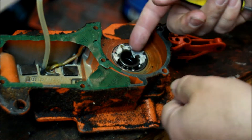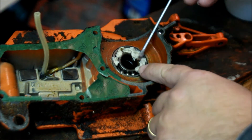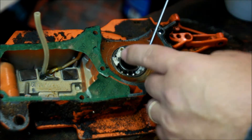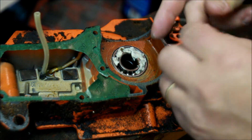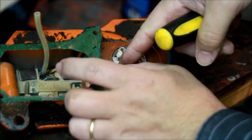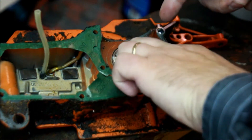If you think about it, we use the inner race here in order to press on the inner race so we can put force on the outer race so we can knock the whole bearing out. And if the inner race is flopping, it ain't going to work. So you've got to keep the inner race in the center. It's not going to force them around and around. All you need to do is more or less hold them in the right spot.